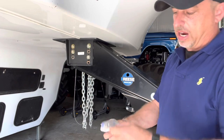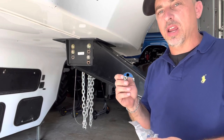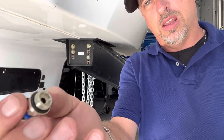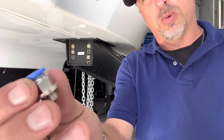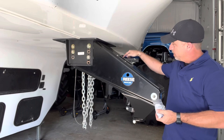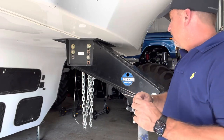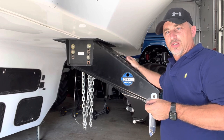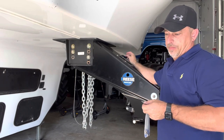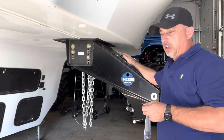You can look on Amazon — I ordered a little pack of these. They're not very expensive. It's called a BSPP fitting — two P's, not one, so make sure you get that right. BSPP, quarter-inch O-ring. I originally had that screwed in on top, but my hose poked up, made a loop, and rubbed — not something I wanted. So I found the right fitting: quarter-inch BSPP to quarter-inch NPT female. Then I used a standard quarter-inch NPT to quarter-inch airline fitting with a 90-degree elbow right up there, and it works great — it's flush, you don't see it.